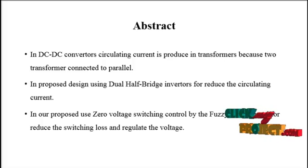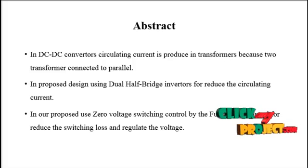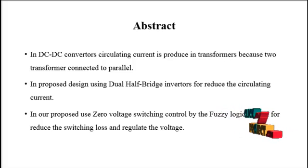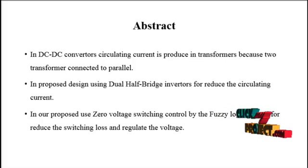One of the most popular topologies for high power and high density switching converter design is the phase-shifted full bridge DC-to-DC converter, favored because of its capability of zero voltage switching operations, which minimizes switching losses. This converter configuration is described in detail in Texas Instruments applications. However, a large circulating current in the topology gives significant conduction loss at heavy loads, while at light loads, the circulating current becomes too little for switches to achieve ZVS. Both characteristics impact maximum efficiency — reducing circulating current and achieving soft switching over a wider load range are two key areas to improve the phase-shifted full bridge converter's performance.